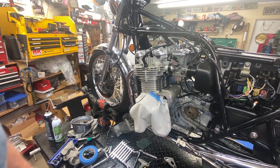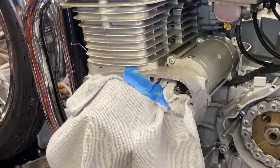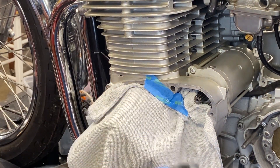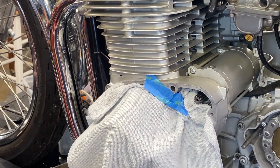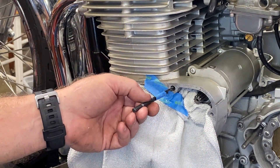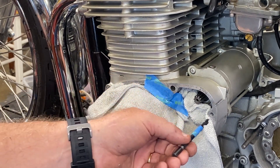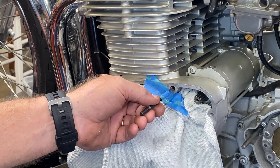It's going to be real tricky, so I figured I'd show you how I do it. We're all masked off here for chips. I'm going to put a little WD-40 in there. I've got the tap drill for the M6 helicoil in the drill. I have the depth set - I measured it with a little straw from a spray can. The first thing I'm going to check is to make sure we're not going to cut any of that counterbore out - which we're not.